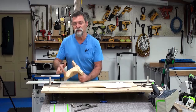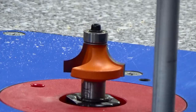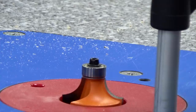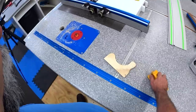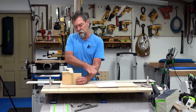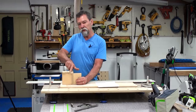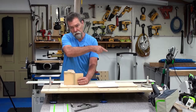Once these curves were done, I grabbed a round-over cutter out of the drawer for the router bits and popped it in the router table, then lowered it down. How good are these cranks? You can lower it down and have all the control from above the table. Got it right and then using the grip-style push block, I approached the router cutter from the left and moved towards the right. This little guy here is the stop block. As the saw is coming back, that's where the rail finishes, but the back of the saw will hit here so it's not going to go back any further, which I just find is a nice little handy thing. Originally this was also going to be a hose guide for the rip section, but it didn't really work too well.